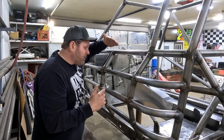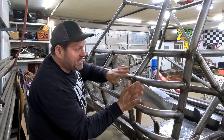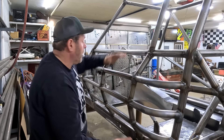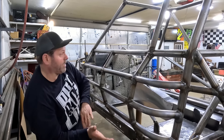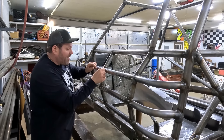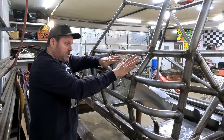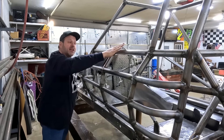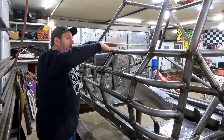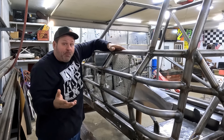So I'm going to go weld it on from the top all the way around to the frame. And then this part, I'll cut individual pieces and stitch them in, because that's tricky — there's lots of angles going on right here. This one's easy because I can just take and weld to the frame and roll it over and trim it and weld it. I've already ground down where my welds were kind of sticking out — I just flattened them off so I can fold it over. I know I'm going to roll this one down and weld it in because that's a safety thing.